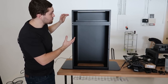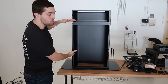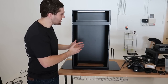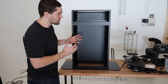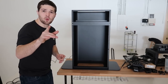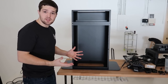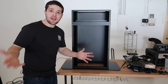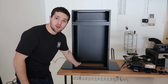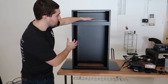We put it up on a table so it's easy to work on. The rack portion is probably the main selling point — you have a 10U rack here that you're able to mount stuff in. Based on the depth, it's basically a 19-inch shallow rack, so anything that fits in your standard 19-inch shallow rack will fit into this. I do want to point out: this is one of the first prototypes — the ones shipping out will have the holes in the bottom and top removed so you can access the screws to mount your top and bottom.